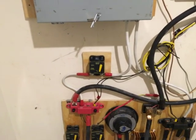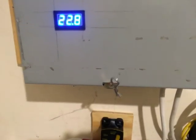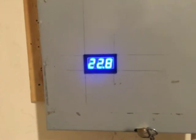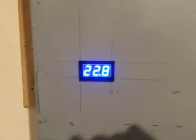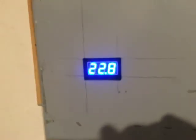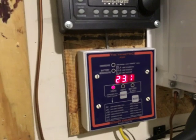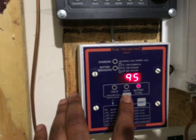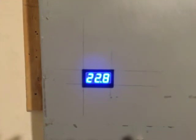I now have three circuit breakers for each power source — one for the ultra capacitor bank and two for both battery banks. I've got a little clip to keep this covered. The reason the capacitor bank reads 22.8 versus the battery bank's 23.1 is probably due to the protective circuit boards — there are six of them and each one has a resistor. But 23.1 versus 22.8 is not bad. Right now I'm pulling about 32 amps from various sources, I'm at 95 percent charge, and we're going to let it run all night long.